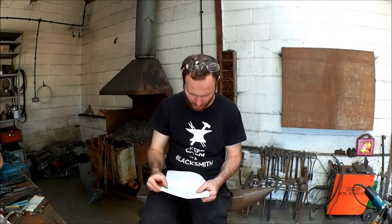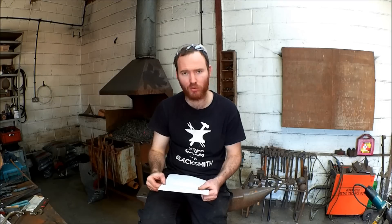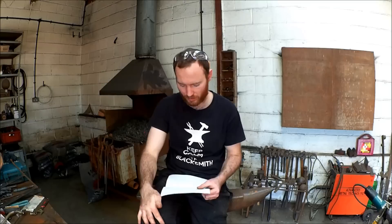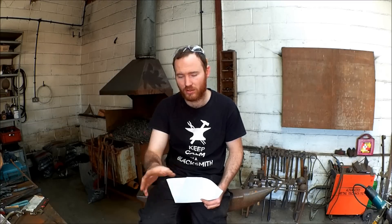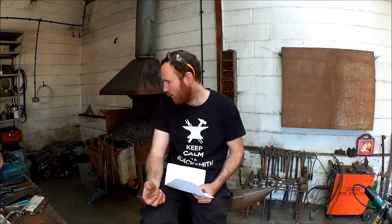From Stephen P in the BC: will it work with coal? Yes, it will, and I'll do another video on that later using different types of coal, charcoal, and coke, showing all the differences in forging and especially fire welding — because getting the right temperature is the main thing. Some fires produce heavier scale, but using all those fuels on the side blast is absolutely fine. You might have to change your method because fuels work quite differently to each other.